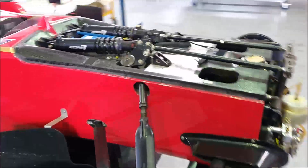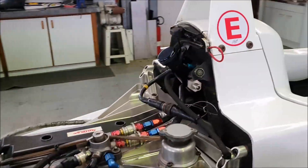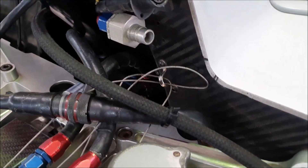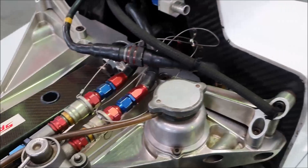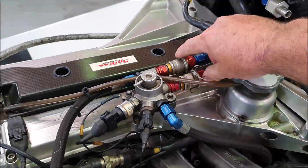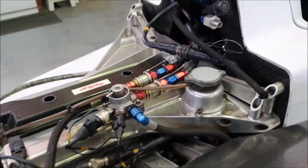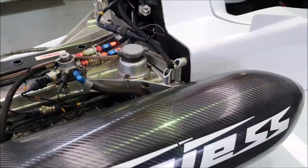We'll wander over and have a look at the other chassis — it's a Dallara F304 and probably better explains the actual design. It also bolts to the back of the tub but this one even has quick release couplers on a tether. So when the studs break and the engine and transmission come away from the car, the cables pull on the quick release couplers — the fuel lines and oil lines disconnect. It's a zero-drip setup, so there shouldn't be any fuel spillage at all should the car come apart in an accident.